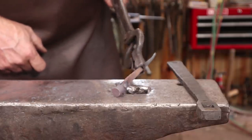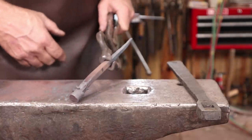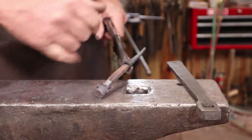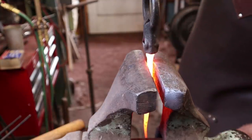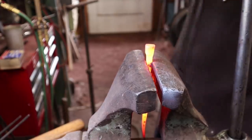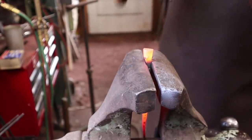I'm going to go grind those off and see if I can find a header that's slightly smaller. The other option would be to lock it in the vise at this point, get the upset established, and then go back to the header. My next smallest nail header is a lot smaller than I want, so we're going to use the vise to work on this upset.